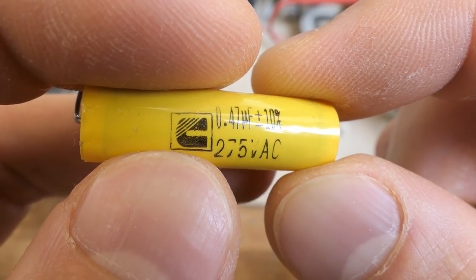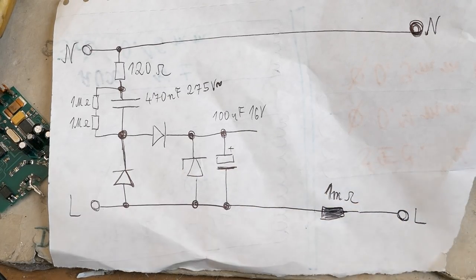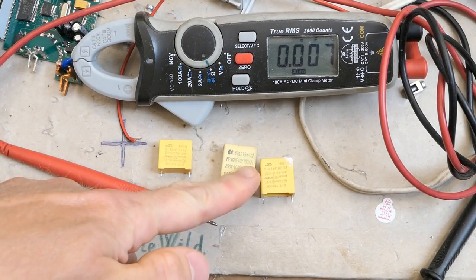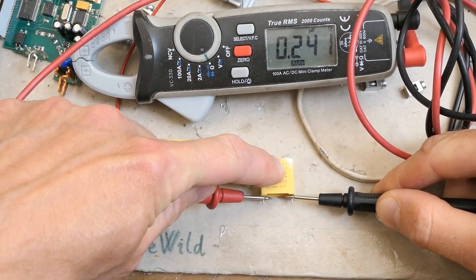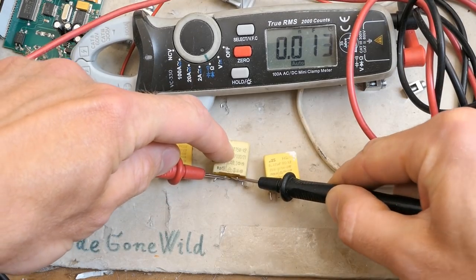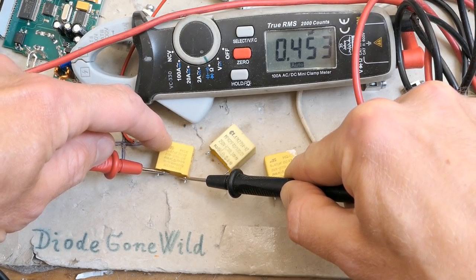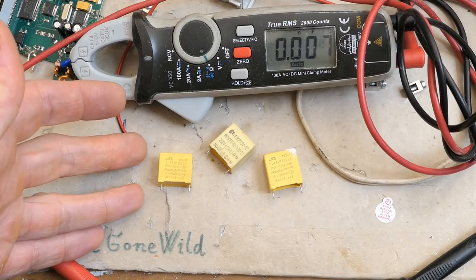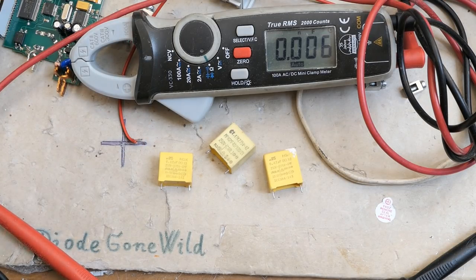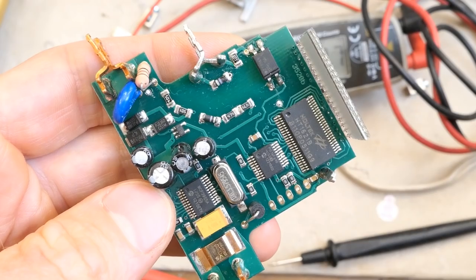It lost most of its capacitance and doesn't supply enough current, so the zener diode in the power supply can no longer regulate and the circuitry doesn't get enough voltage. Let's try to give it another 470nF capacitor — AC 250 or 275V, Class X2. These are salvaged from other electronics: this one is 240nF — half of what it should be. This one is 390nF, kind of close. This one is 450nF — close enough. These capacitors are probably unreliable because they're connected straight to mains voltage, and if there is an over-voltage spike, the capacitor self-heals by disconnecting a shorted section. These are self-healing capacitors, but the self-healing mechanism actually makes them lose capacitance.